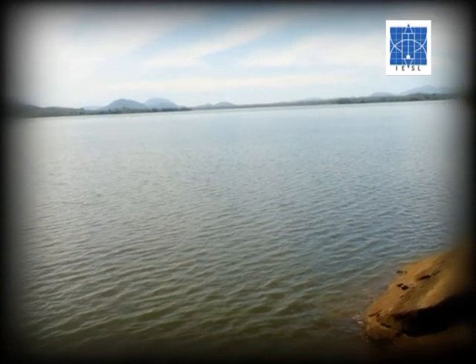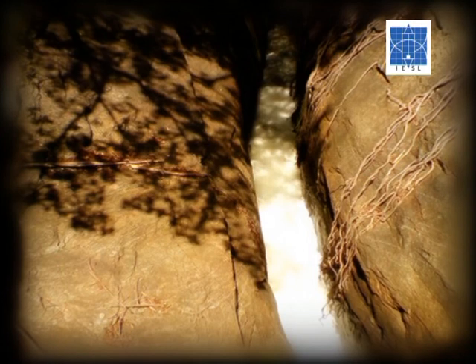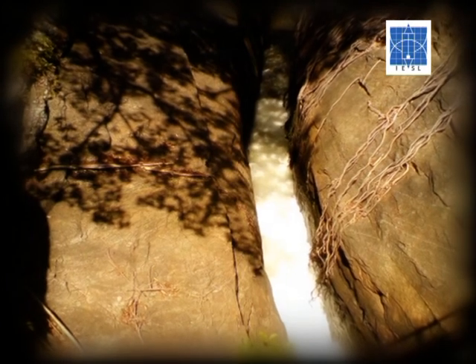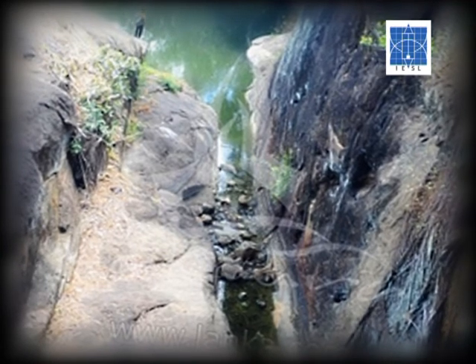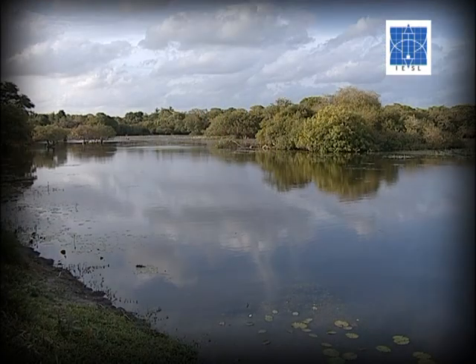What you see here is the Saurabura Reservoir in Mahiyanganaya. It was made by a giant named Bulatha. Despite being a large reservoir, there is no Biso Kotuwa. Here the outlet sluice is made at the place where natural rock exists as the dam, formed by cutting the rock from the top. Therefore, pressure and velocity of water is not a problem for the stone sluice, and this reservoir needs no Biso Kotuwa.